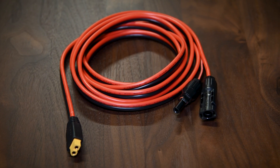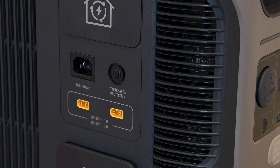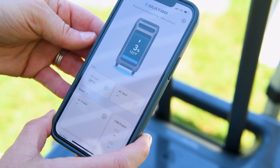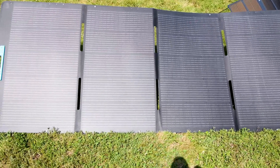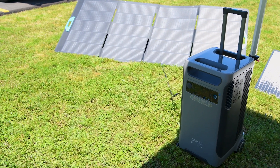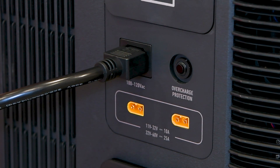I was able to purchase a 10-gauge 10-foot wire from Amazon for about $20. With an additional cord, you can also use these XT60 ports with your car's auxiliary output port to charge this station at 120 watts. We connected one of the Anker 400-watt panels — only one-sixth of the input it could receive — starting at noon and let it charge with solar input for just under four hours, seeing a 13% increase in state of charge. Multiplied by a full six panels, theoretically we'd be around 78% state of charge after four hours. The manual states that bringing it to full charge through AC takes just under three hours at maximum speed with a max input of 1,800 watts. Let's test that and see.